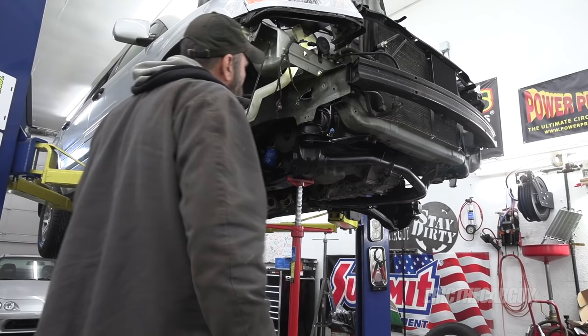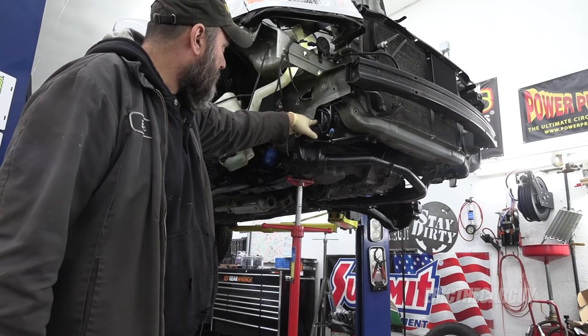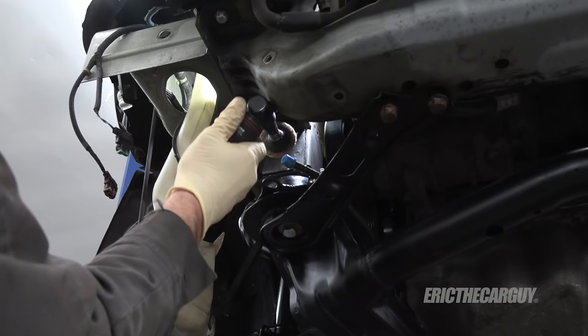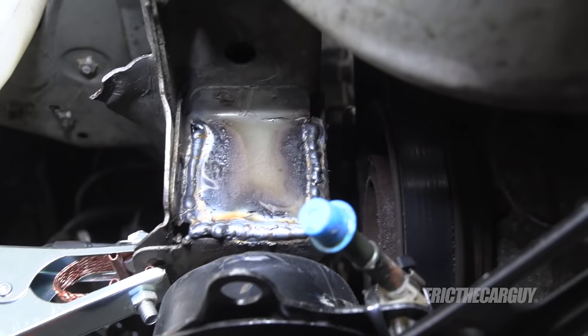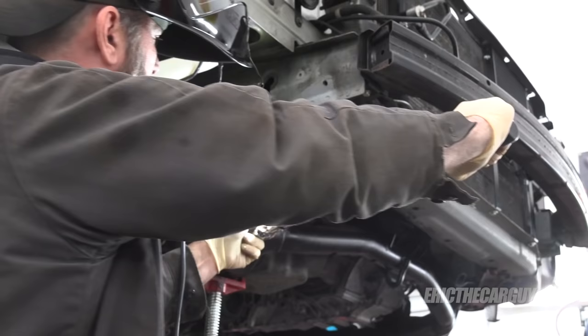Let's get this torqued to 95 foot-pounds. Before I run this down and give it the final torque, I'm going to leave it supported and close all this up. Because if I put a clamping force on this and this isn't quite here, or if I go to weld this after the fact, it could be distorted. Remove some of this paint to make it easier to weld. Ugly, yes. Effective, also yes. The biggest reason it's so ugly is because I didn't prep the surface as well as I could have. And then torque this to spec.